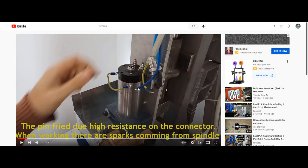That being said, instead of dealing with tapping your spindle body, instead of dealing with removing the end cap of the spindle, which, again, I've sent numerous pictures out reflecting the end cap removed on the spindle so that you can solder on a lead from the fourth terminal to go to the end cap, you could easily just mount the spindle into a conductive area. Once again, the mount would be conductive if it did not have an anodized coating on it, and then, of course, mounting the mount onto an actual piece of steel or aluminum like we see here, which is bare, and you will have a grounded spindle, hence if you ground your CNC chassis.